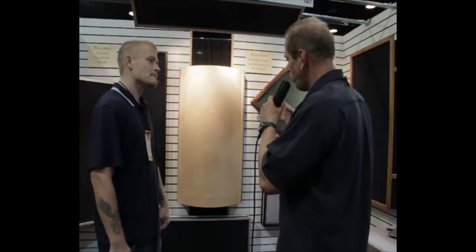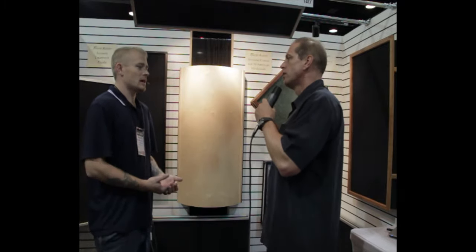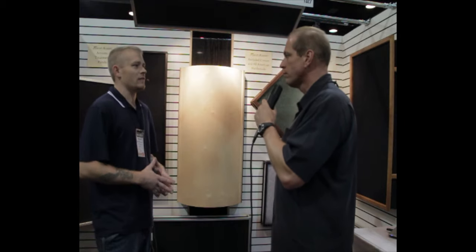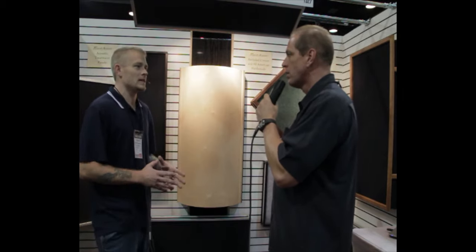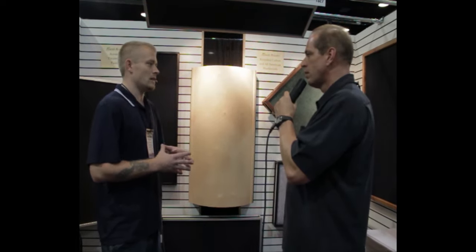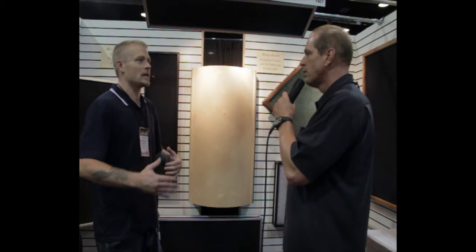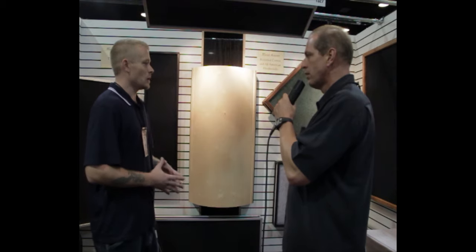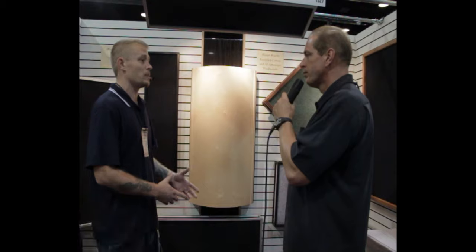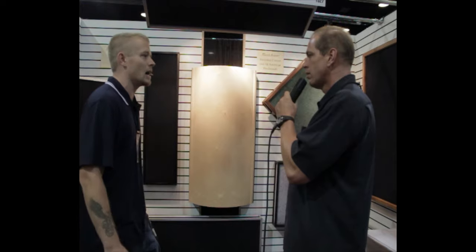Normally you'd test your room with software to see if you need more bass treatment. A lot of times smaller studios and smaller rooms are all going to have a low-end problem. The high-end problem is pretty easy to treat — foam and similar products can handle high frequencies — but it's really the low frequencies that build up in studios. Entire frequencies can cancel themselves out depending on the dimensions of your room. So in smaller studios, treat as much as possible at the low frequencies, and the high-end will be taken care of naturally.